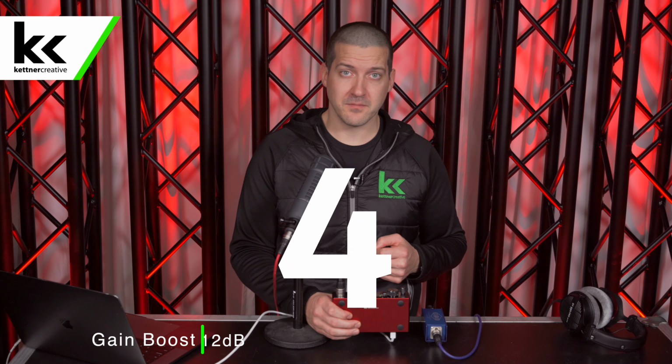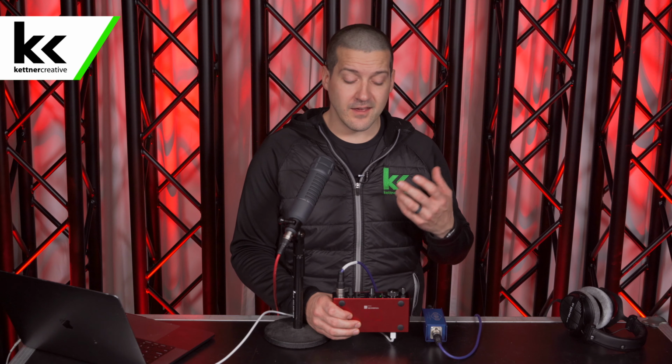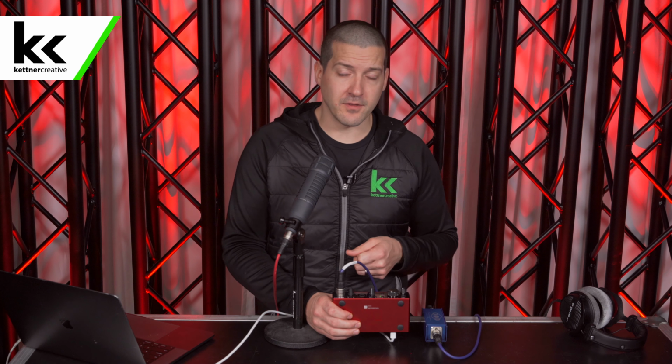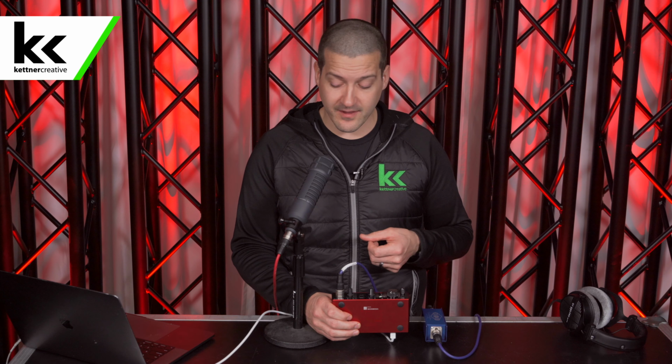Okay, so what we're going to do now is pause for 5 seconds again to see if you can notice any more or less hiss than we noticed before. I would expect that you would notice a little bit less hiss. You may need headphones and really turn them up so you can hear the difference. But I would expect with the Cloudlifter that we're using less of the preamp and there would be less background noise because of that.